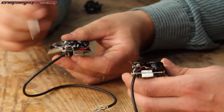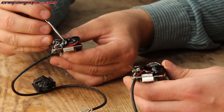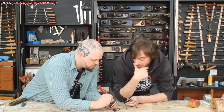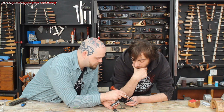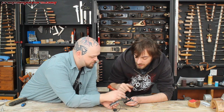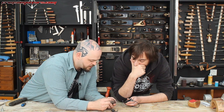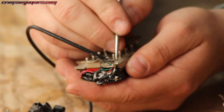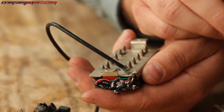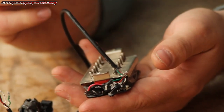I've just ripped the tape off the edge, and those individual things are actually shielded. Taped. Heat shrink would definitely be better, and I think neater. What might have happened is that James was trying to repair that, so I'm not sure. Let's assume this is how it arrived. It's not as bad, and it looks like he had shielded the cord there. Essentially, we've had this apart and tried to fix it. This still is shoddy, and the soldering is bad.